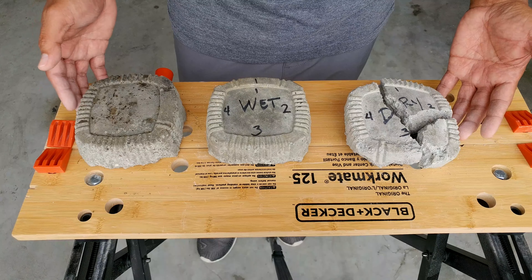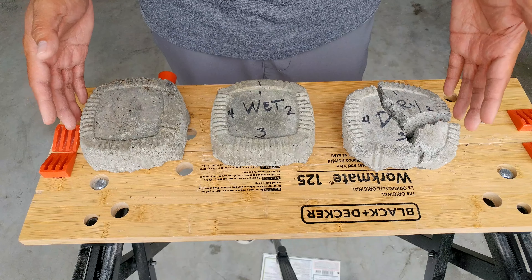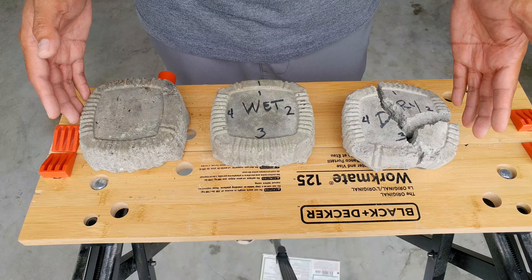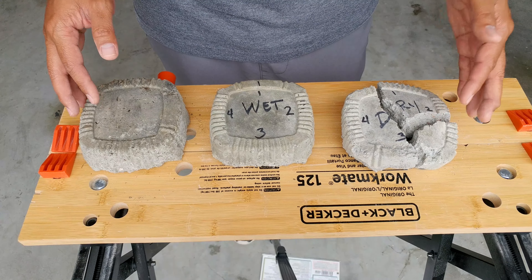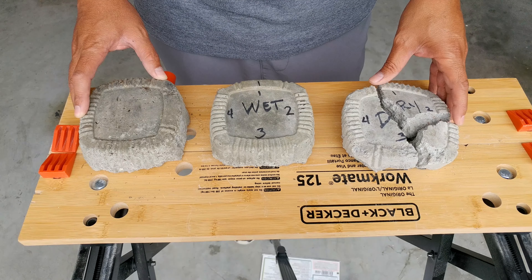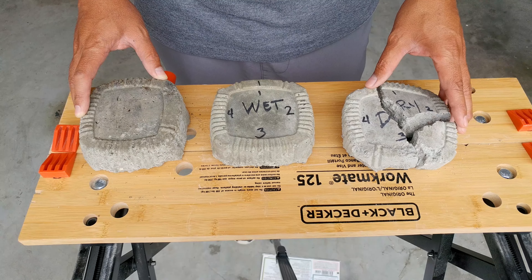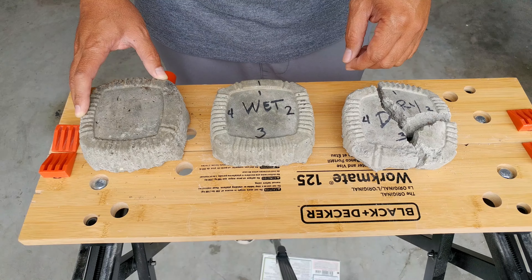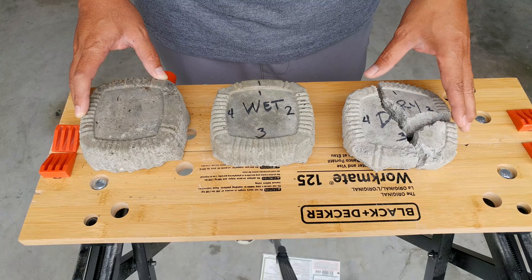Also, a walkway or backyard slab does not really need 4000 PSI concrete. The only thing I would say if you want to use the dry pour method is to make sure that you continue to water the concrete and keep it hydrated for the full 28 days, because even in the wet pour method they advise keeping the concrete hydrated for 28 days for a stronger cure. I hope this video is helpful. Please subscribe to my channel, hit the like button, and comment below if you prefer the dry pour method or the wet pour method — and if you're using the dry pour method, what will be your limitation? Thank you for watching.